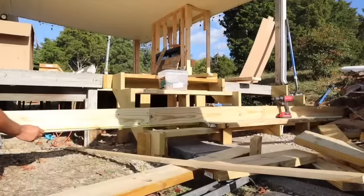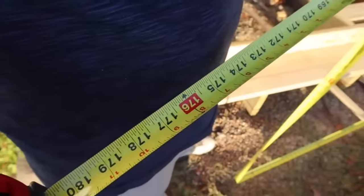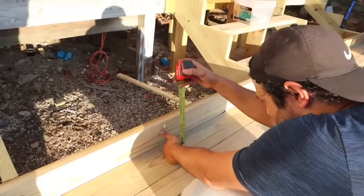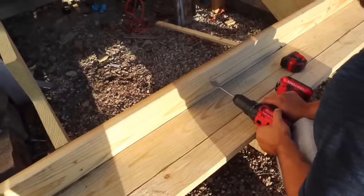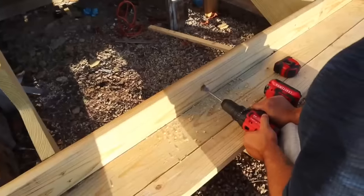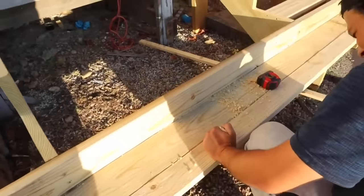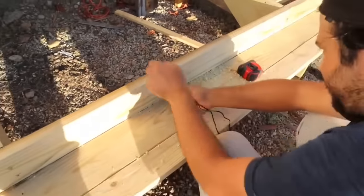Shane's adding in supports under the steps. We're back over here at the steps now. He's adding supports underneath every single third. We basically built the guts. When I say we, I mean he. Just always know that. We basically built the guts of the stairs in one third increments, and then on top, the cosmetic faceplate of it, we made it look like it was one full step.